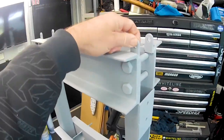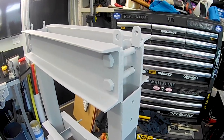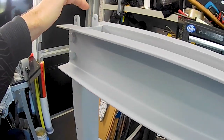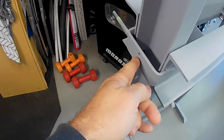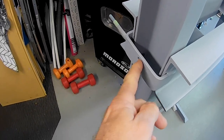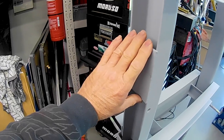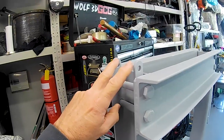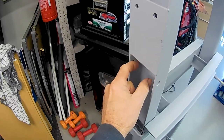These pieces of steel that are welded on the top here, they're basically just to run a bolt through that carries a bearing with a groove in it to bring the wire from the winch up and over the top here, and then down the other side where they'll hook on down here on each side. I've drilled a hole through this piece here. This is another mount that I've made up here which holds some press pins that I've got. Once again, up the top, another setup for a roller.